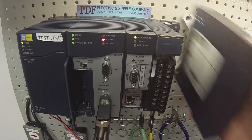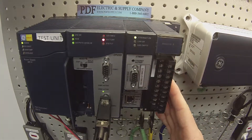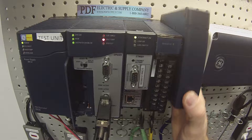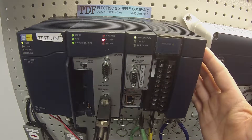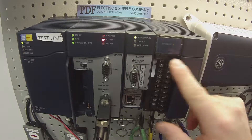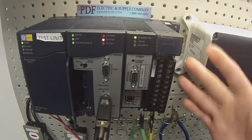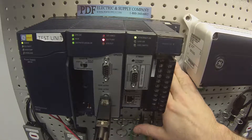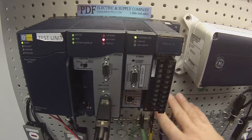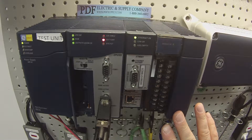In a factory application, if there's anything moving that could damage this — this is an IC694ALG220, an expensive module — perhaps I could have this to the side. If anything did hit into my rack or fall onto the rack, it would probably only damage the filler module and not my expensive ALG220. Also, if anything could splash against the rack and damage my important slot rack, which could possibly affect the entire rack, that wouldn't happen with this filler module in its way.